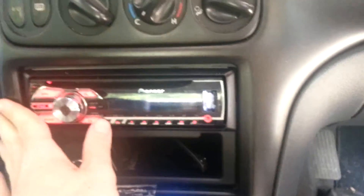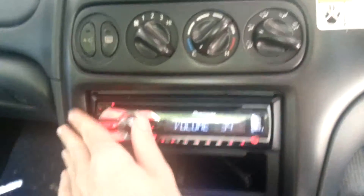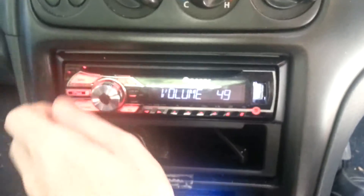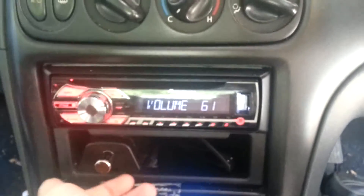I've got a 40 Hertz reference 0 dB track, everything is tuned to 1% distortion or so using the DD1. Cranking this up to almost max to see how it compares.